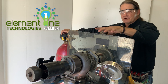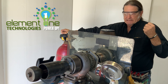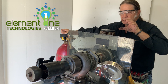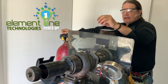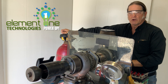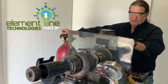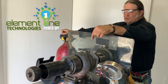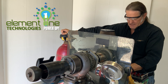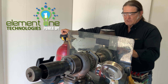Now what is important is that the turbine is running, because it pulls those burning gases — which happens very quickly — out of the combustion chamber and exits through the exhaust. That creates the thrust of a jet. What I'm going to do is turn on the first oil pump, which is absolutely critical in the checklist hierarchy — first turn on that oil pump to lubricate the spinning turbine that allows it to get up to 3,000 rpm minimum.